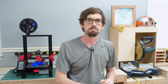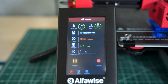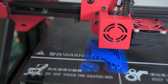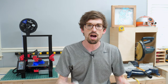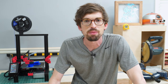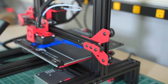Let's talk about some of the pros on the assembly. Overall it's pretty nice for what you get — it's metal construction with aluminum extrusion for all of the sides. The screen is a color touchscreen, which is actually pretty nice for this price point. A lot of times you just have a simple display with a dial. It comes with a glass build plate that has been doing well on adhesion. The gantry is attached with wheels in a V-shape, which has kept it pretty locked in and tight. It's got a 24-volt power supply, which really comes into factor when heating up the hot end. Everything came out of the box great — all the limit switches worked and nothing was bent. Assembly overall was pretty easy.